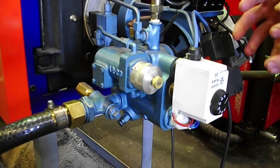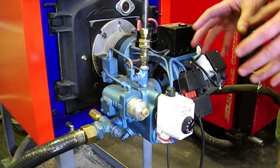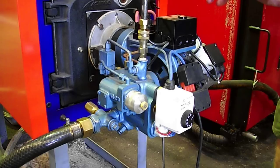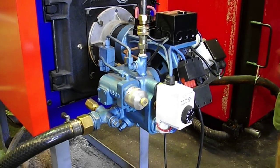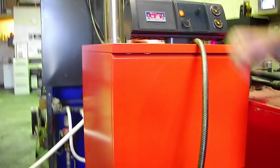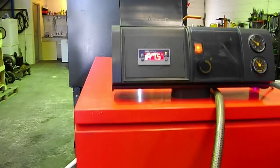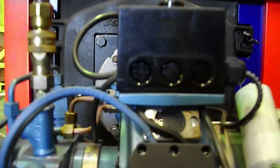With any oil burner, the combination of oil and air has to be correct. Pretty much if there's no black smoke coming out of the flue, it's very close to being a nice combustion. I'm going to start this burner up by turning on the electronic control up here — it'll ignite in about two seconds. And there you go.